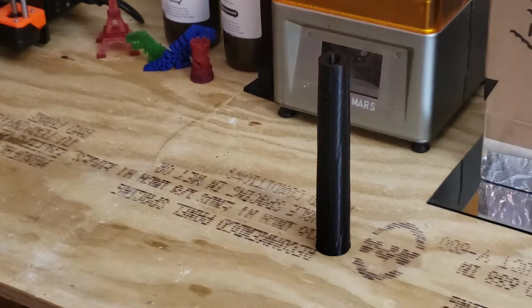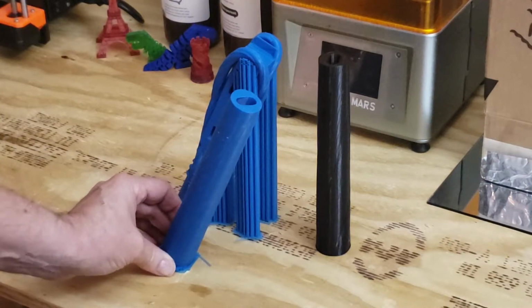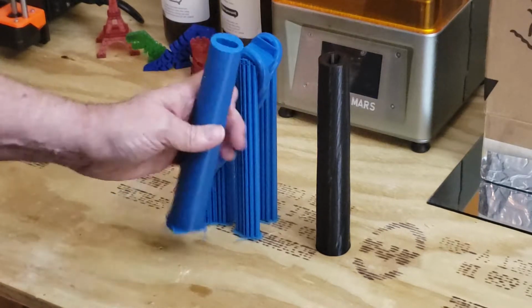A lot of times if you're printing and thinking of your layers, you would print at an angle to make sure you preserve the detail on, say, miniatures. But it can work for longer pieces too. So this piece was printed at a 25-degree angle. 25 to 45 is usually going to be your friend, because if you're printing at only 20 to 25, this did not require any additional supports besides the supports at the bottom. This did because there's detail, but this didn't at all.